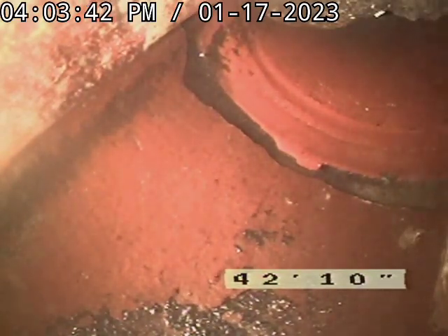Just used the flex shaft to open the sewer line. There are massive amounts of tree roots and a lot of offsetting inside that pipe — they'll be slowing down the sewer.